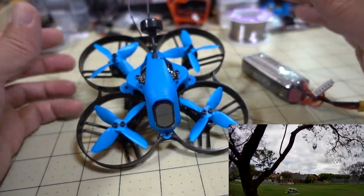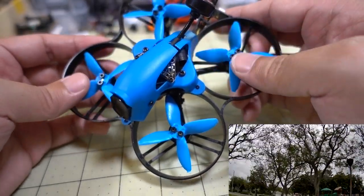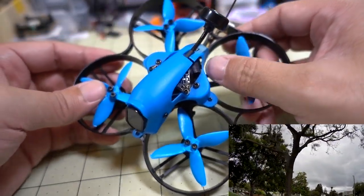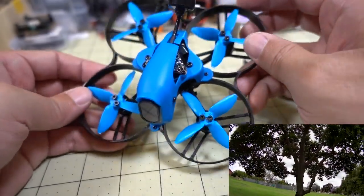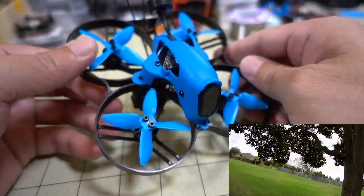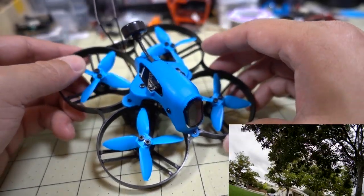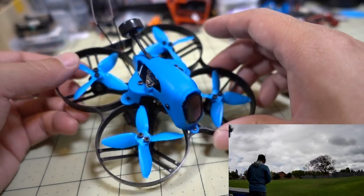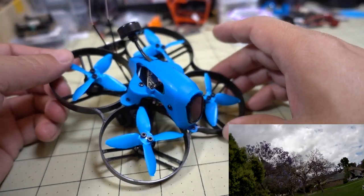Now, in terms of why I'm getting jello, it might be because of the frame, might be because of the props. I did change the props. They sent me an extra set of props, and I just swapped it out. It didn't make any difference in terms of what I could see, so I'm not exactly sure what's up with that. I did fly with the tune that they sent. I didn't really tweak it too much. I thought perhaps the P gains were too high, so I did lower them, but that didn't seem to make any difference in terms of the jello. So yeah,